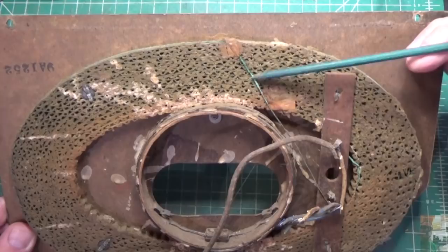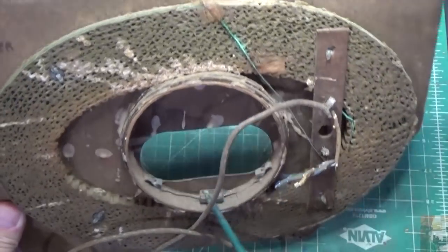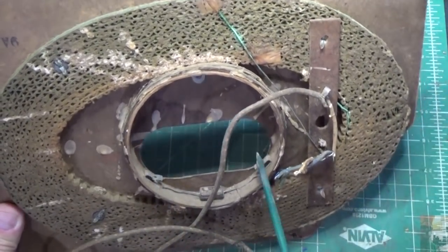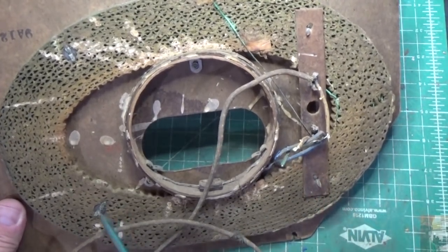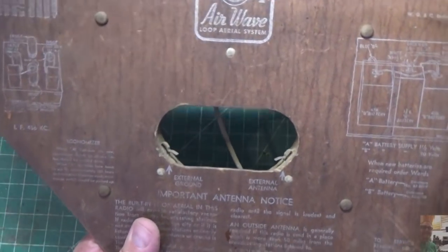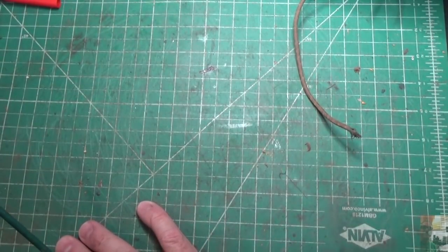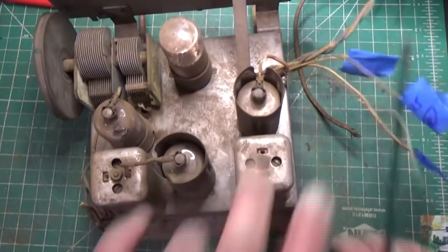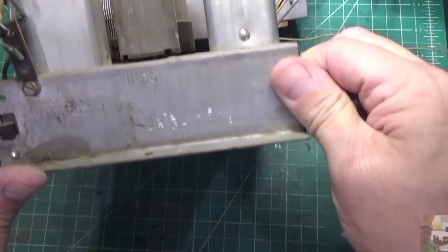I do notice there's a little corrosion on this wire right here, so I'm going to have to ohm this out and see what it looks like. There is a mica cap right in here as you would expect. They also have an antenna lead and a ground lead in here — these are the wires I cut to get this thing off the radio. There are some little staples that hold it in place. There's the external ground and the external antenna.